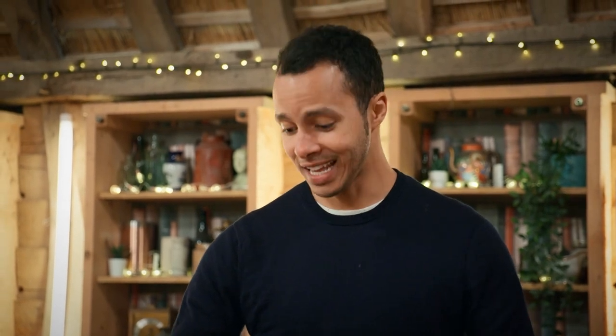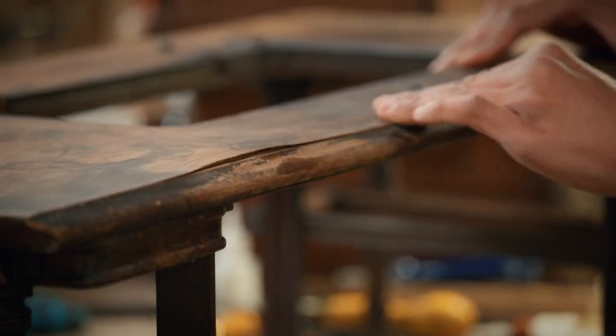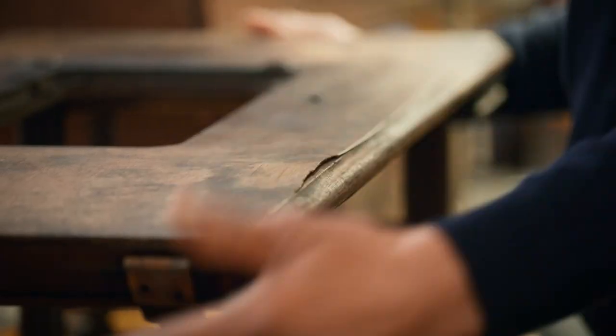This sewing table is probably the driest sewing table I've ever seen — it needs a lot of love. There's some veneer lifting on the top here. I think that's where water has hit the surface, got underneath the veneer and raised off the wood underneath. Hopefully this should be quite a straightforward fix. Just some wood glue and a clamp should get that nice and flat again.